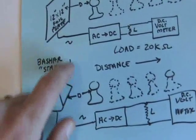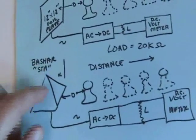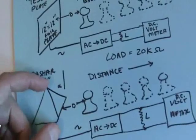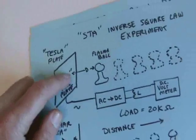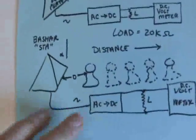There's a certain angle here, so it's not perpendicular to the plasma ball, so the pickup might not be as good. Plus, the tank circuit is tuned for a different frequency than the plasma ball. So this actually does better at close proximity than I would expect it to, and I'll show you the data on that.